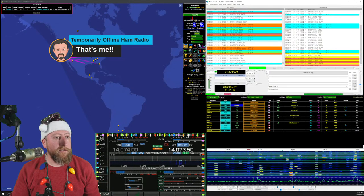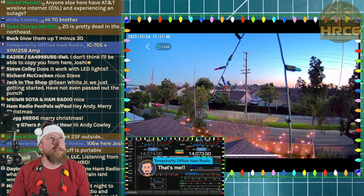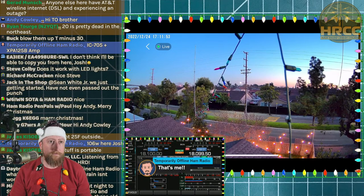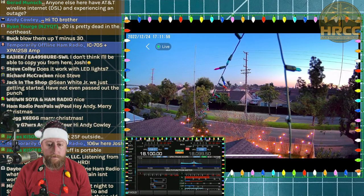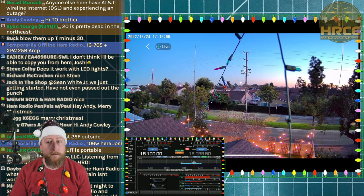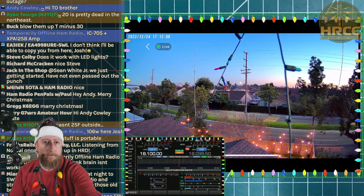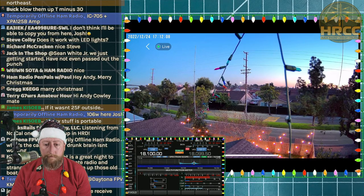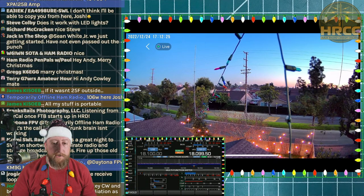All right, we're going to change bands for a second, and we're going to go back to the screen here. Let's go up to 17. Okay, seemed to like that. Let's check it. Okay, the SWR is coming down, so let me go back up to 20.